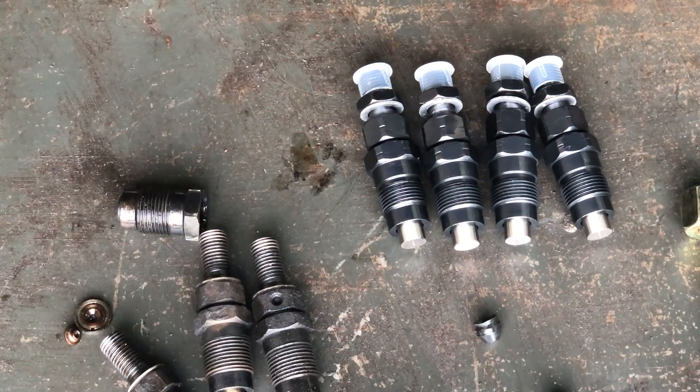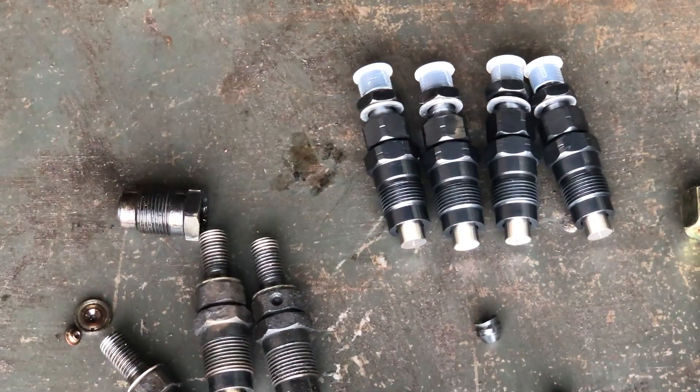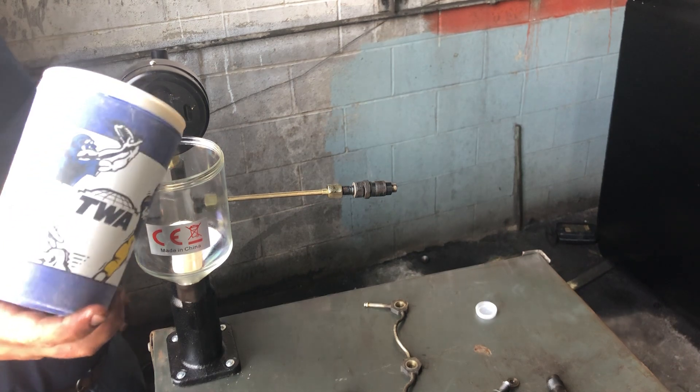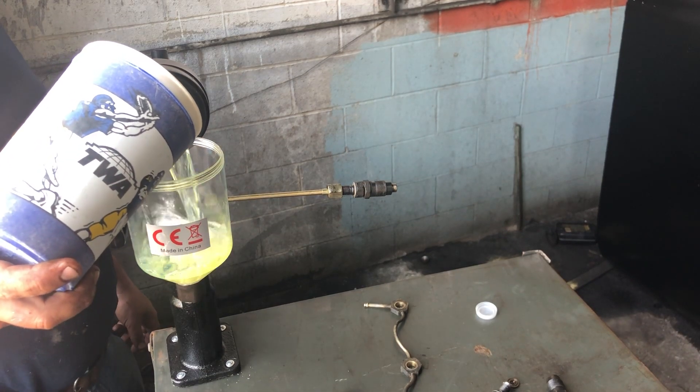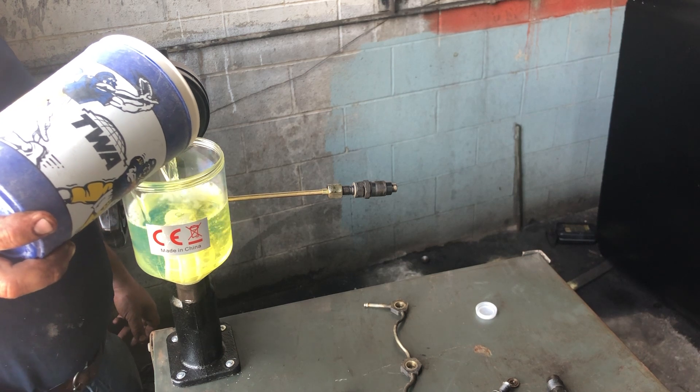So we have the new fuel injectors — I think I may have ordered injectors for an S4L, because they are a much more prevalent engine and I think Caterpillar uses those engines in some of their machines. The S4E is not as prevalent an engine.